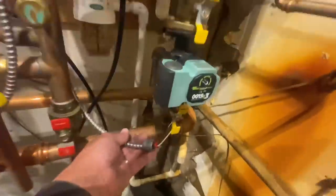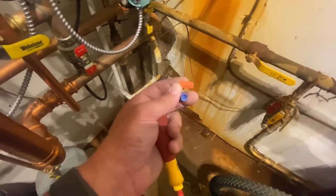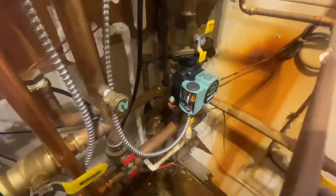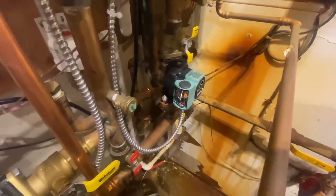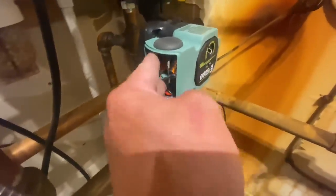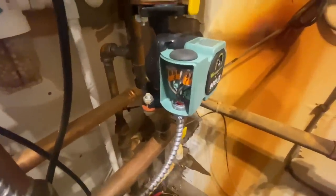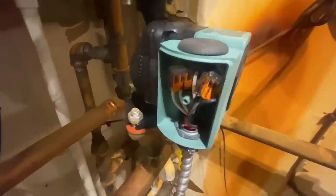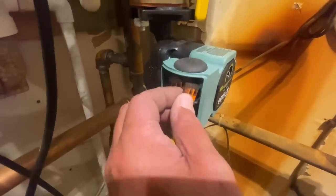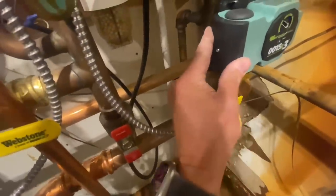All we've got to do now is wire in our line voltage. That way our primary loop circulator will get power and will restore domestic hot water here. I got it wired. It's crazy how we advance and evolve over time. When we installed this tankless wall-hung combi for this homeowner — replacing a Weil-McLain Ultra 2 that developed a hole in the bottom of the heat exchanger — we were using wire nuts. Not anymore. Now we're using the Wago 221 lever connectors. These are far superior to any wire nuts. I'll put a link in the description box below. You can get them on Amazon — about 50 or 100 for 20 to 30 bucks for the two-conductor ones. Let's put on our electrical cover and get that show on the road.